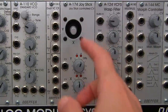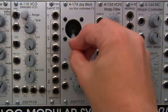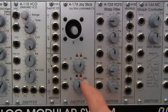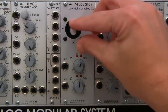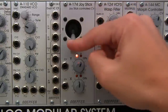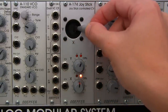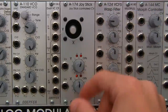The A174 is going to output two control voltages via this joystick. One voltage is generated when you move in the up-down direction and one voltage is generated when you move in the left-right direction. There are two LEDs for each axis that will indicate your positive or negative voltages at the corresponding outputs. Moving up you can see a positive voltage at the output, and moving it down the negative LED lights up. Moving right the positive LED lights on the X output, and moving left the negative LED lights.